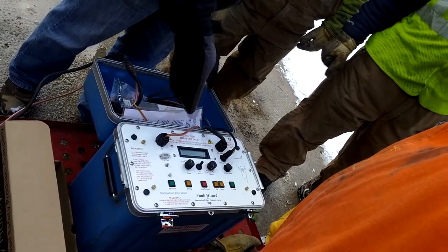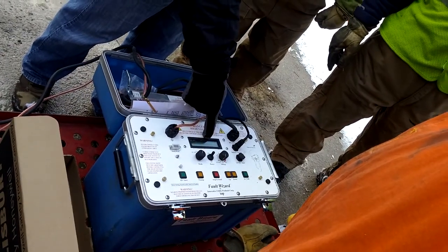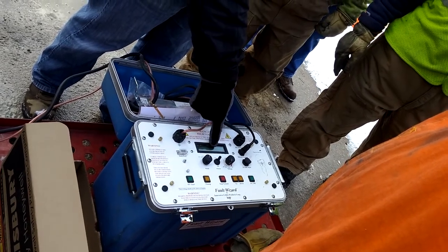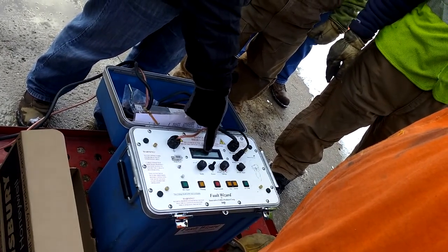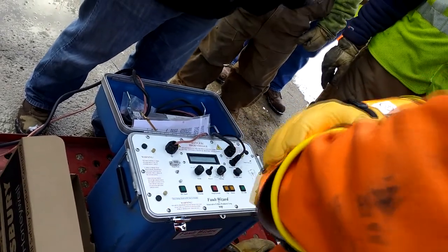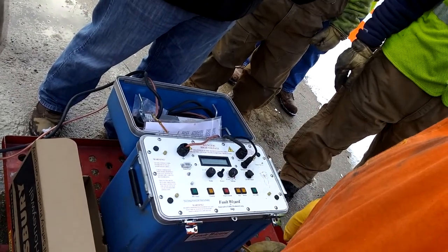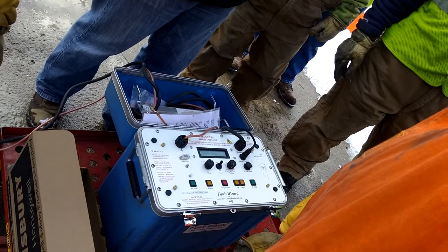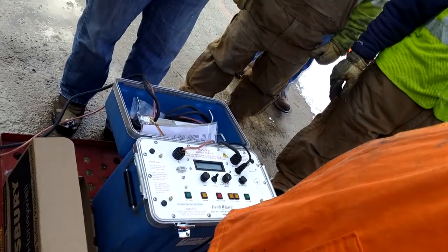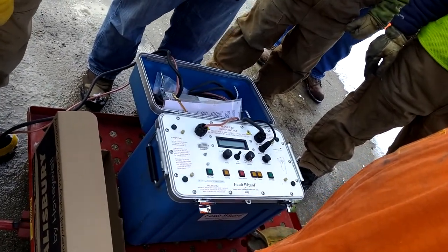What we see on the screen is your output voltage in the top left-hand corner, your battery voltage in the top right-hand corner, your footage to the fault in the bottom left-hand corner, and what type of fault it is. It will say OP for open or SH for short — it should always say SH when you're faulting out a cable with this machine. If it comes back and says RF, that means resistant fault, meaning you're going to have some strange readings. That happens when your concentric is corroded away and can't arc to itself.